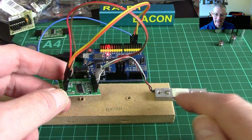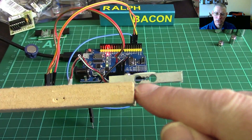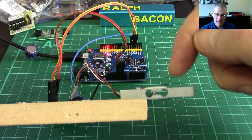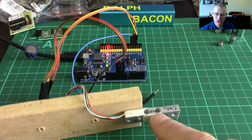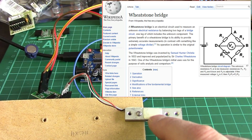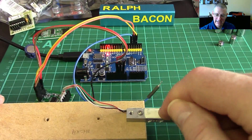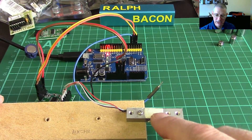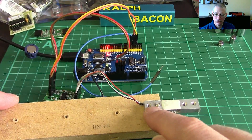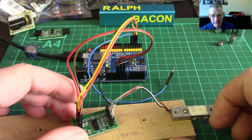What is this exactly? It's pretty much as it looks — an aluminium bar with a few holes drilled in it. The bar flexes just enough when you put weight on it so that the components under these blobs of material flex. What's under there is actually a Wheatstone bridge resistor network — probably four to six resistors. When pressure is applied, one set of resistors gets stretched microscopically and another gets compressed. That's enough to generate a difference in potential across those resistors, which means a signal can be measured down the wire.